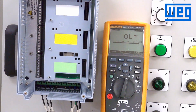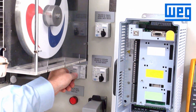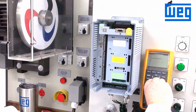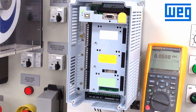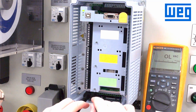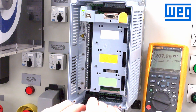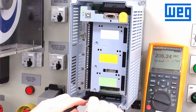Okay, that all looks good. So the next thing we will do is power up the drive and check for voltage. We will set our meter on AC volts. The system we're testing with here is a 208-volt power supply. So we measure L1 to L2: 207 volts, L1 to L3, and L2 to L3. So we do have proper voltage.